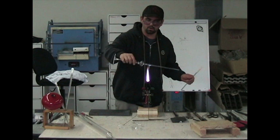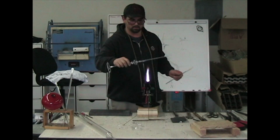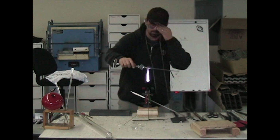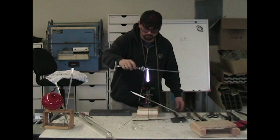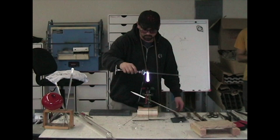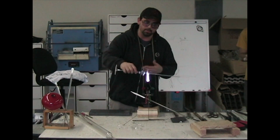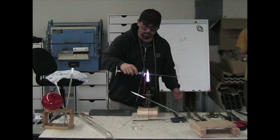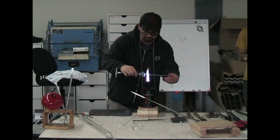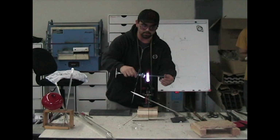Here's when I cut off the top point and make this all the way sealed. Pretty important here to heat in slowly. I don't want to add a lot of stress to the top of the bubble where it's going to have some heat and have the force of the air that has contracted trying to suck it in after it cools off.